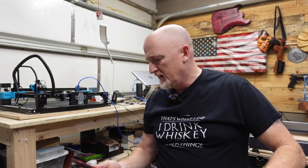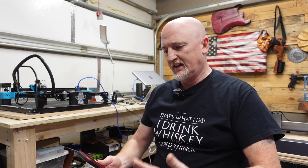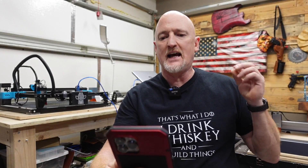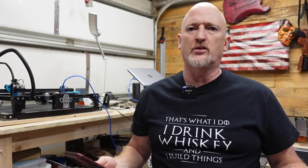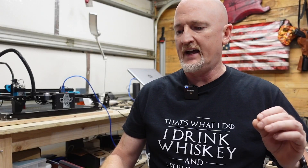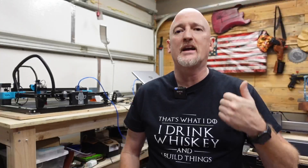Now that we've had sufficient time to kick the tires on the old Two Trees here, I wanted to give you some more nerd facts. The model is TTS 55. It's made out of aluminum metal. The control board is an LTS ESP32 32-bit. Engraving size — the bed is 300 millimeters by 300 millimeters, so it's a little smaller than your normal ones, but you can buy an extension kit for it. You can get a USA, EU, UK, and Australian plug set. The accuracy is 0.08 millimeters. The top engraving speed is 10,000 millimeters per minute. You can access this via USB, app, or Wi-Fi, and it supports Laser GRBL and LightBurn.